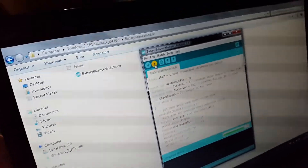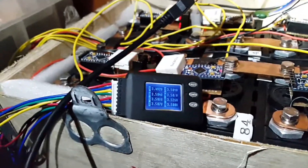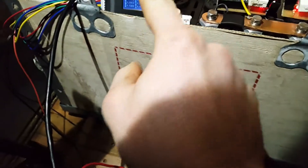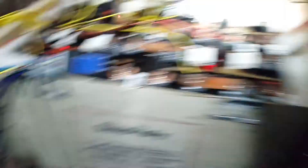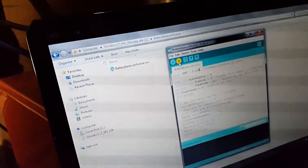I increased the value when I was meant to decrease it. After playing about with it, increasing this value actually reduces the voltage that it balances at — so increasing that brings the voltage down more. It's still at 3.511, so I've just got to keep adding to this until I can get the voltage down a bit.